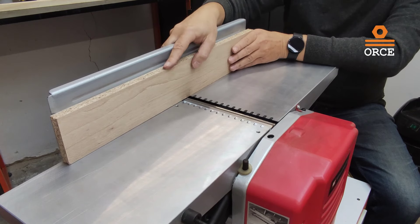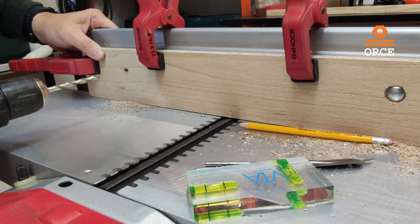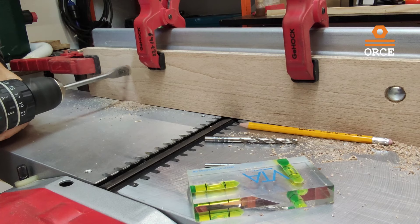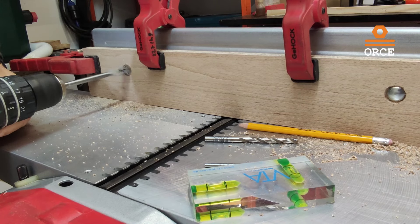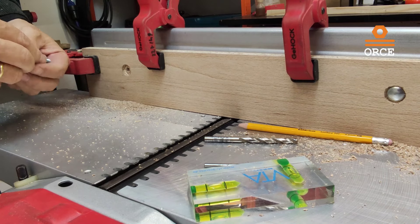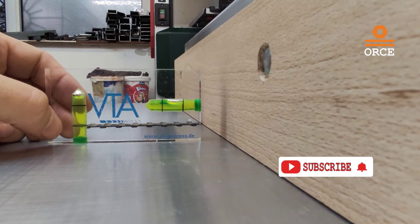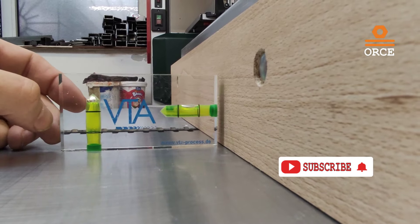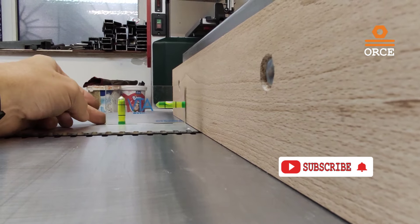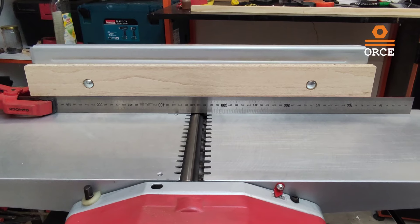What can we do to make this fence better? The solution is very simple. We are going to use one piece of material, place it like this, then put two bolts — one here, one here — and fix this piece of wood to the rail. Now we are going to check the results of our work. As you can see, the angle is now perfect on both the front and the back plate.